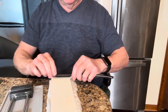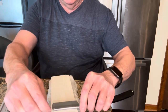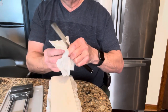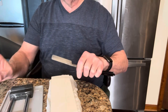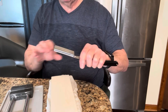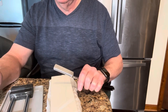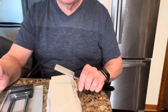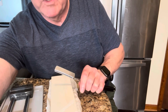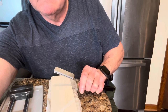What I'm going to try to do is get to where I look under the scope and what I am seeing is a distinct difference between what I see from the arc with the slurry — which is a frosted type finish — to a more of a clean polish on the edge. Then I'm going to come back probably again with another type of back beveling with less curvature than that four-foot wheel, probably going to the six-foot wheel. So see you then.